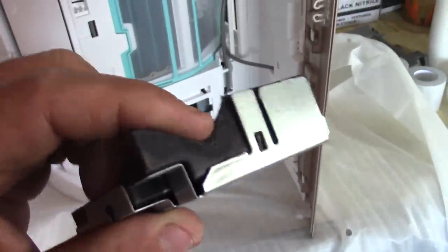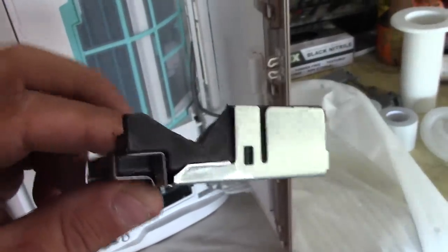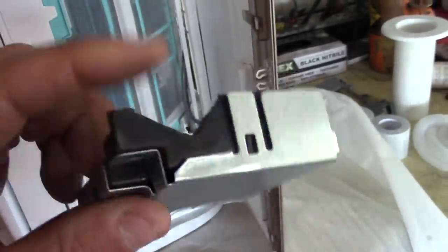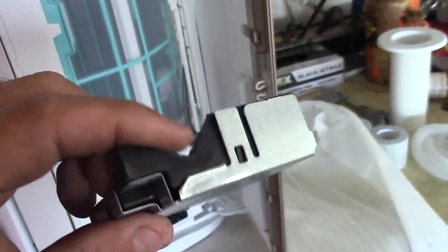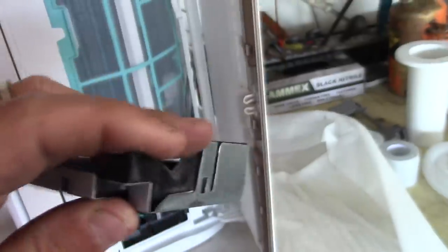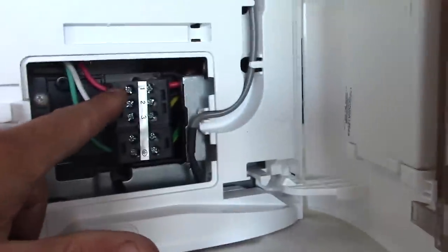Now I took a nipper and I cut that V out of there, and that's just to protect the wires so that they're not being crushed. Okay, I also snipped away some metal here and I filed that so that it's smooth. So the wire runs through that hole, through the wire clamp in the back, and then it comes out here, and they have the lugs labeled